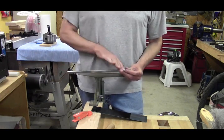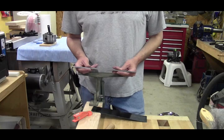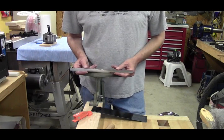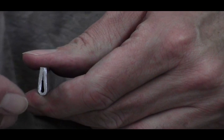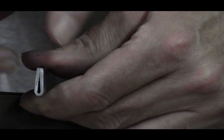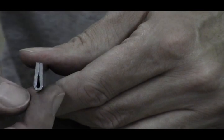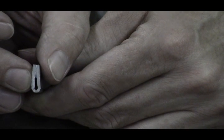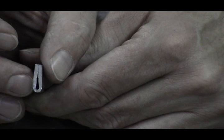At that point it was bowed and bent and quite a mess. I came home and put it on a piece of railroad iron that I use as an anvil and used a dead blow hammer to straighten it, which worked pretty well — it took a little time. You can see on the end where it's folded, the bend radius at the top leaves it a little bit thicker at the top than at the bottom. On a Jackson saw that I have, with the blade in it, it's about 25 thousandths wider at the top than at the bottom. This one currently is about 50 thousandths. When I put the blade in there, that'll get it to about 25 or 30, so it'll be comparable to a factory saw.